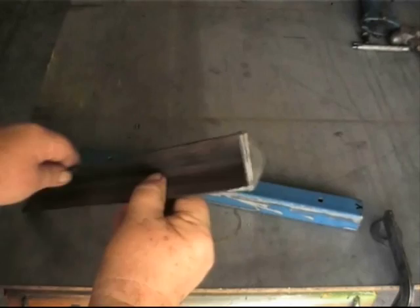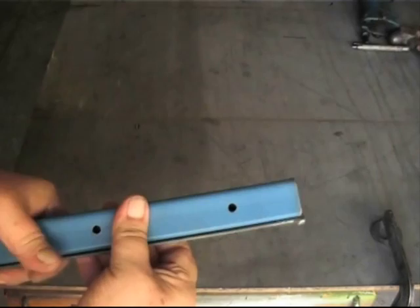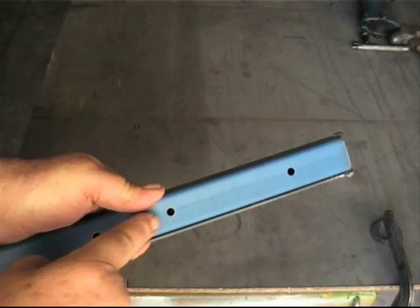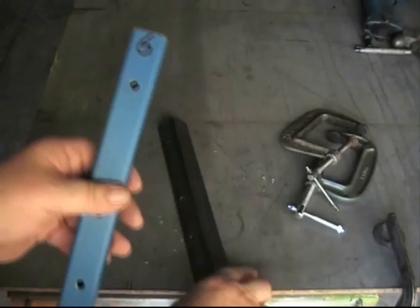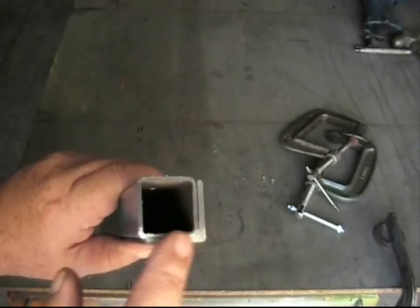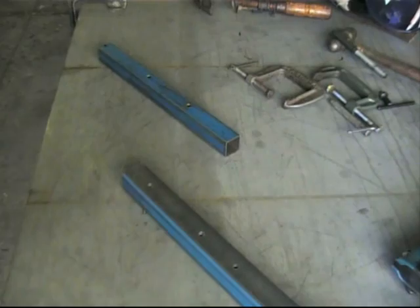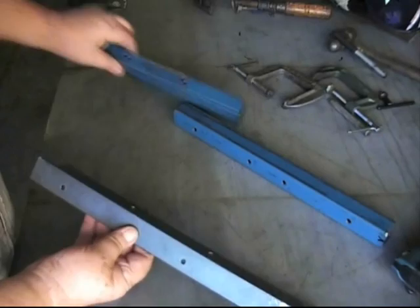Next, cut a piece of 30mm angle to the length of the post and weld a stop to one end. Slide the post into the jig so that it rests hard up against the stop. You can now use the quarter inch holes in the post as a guide to drill straight through — I suggest that you clamp your post into the jig when doing so. Even though the holes in the post are on the centre line, you will notice that the holes on the jig are set off centre. This is why it is best initially to make the jig fit the post. It also acts as a marking stencil to get the correct length of the posts. You will find that posts numbers 5 through to 8 are longer than posts 1 through to 4.